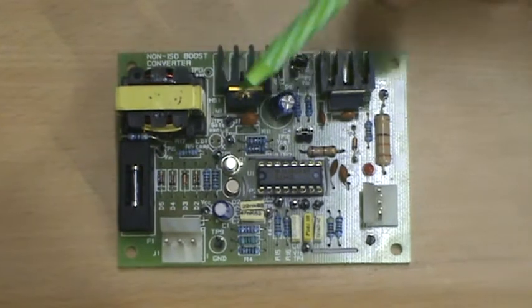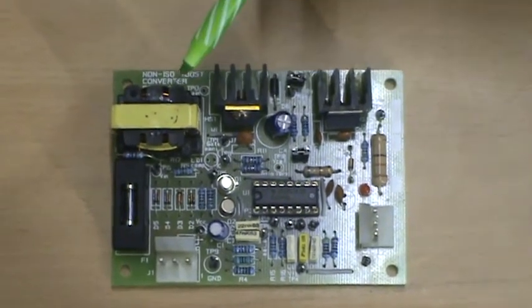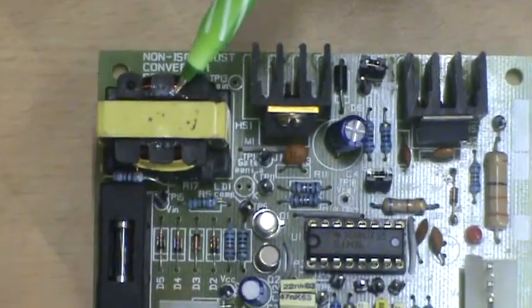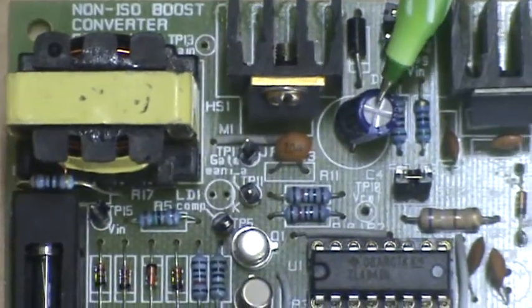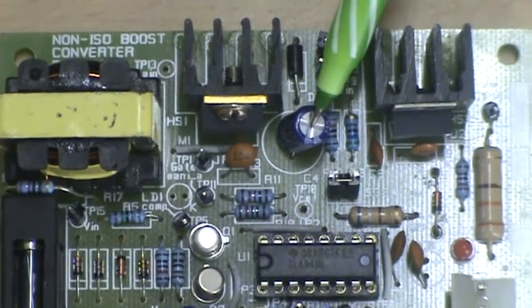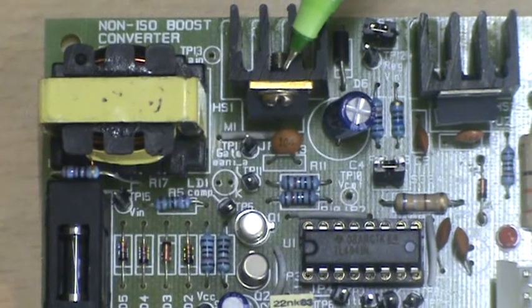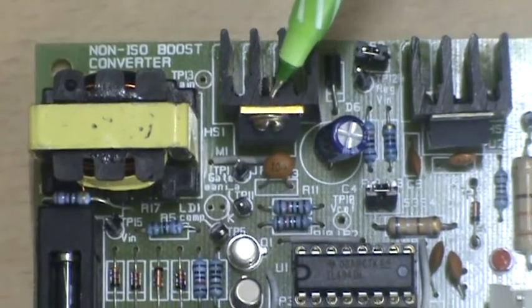This is my hardware kit, which is the 7.5 watt non-isolated boost converter. The main components are an inductor of value 110 microhenry, designed as 110 microhenry, a filter capacitor of 220 microfarad, designed as 220 microfarad, and a MOSFET. For high switching frequency I have used a MOSFET of IRF Z44, an N-type MOSFET.